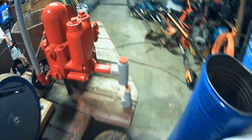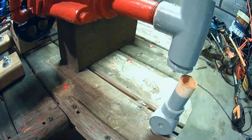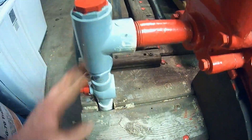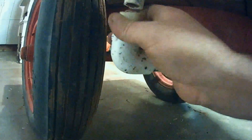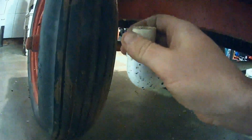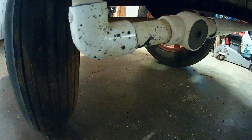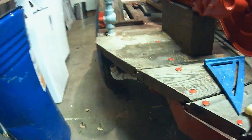So the next thing I need to do is be Mr. Plumber and fix this PVC misalignment. I'm just going to make it a little wider right there, cut the line and pull it back, put a coupler in it. I pulled out the jigsaw and widened out the hole, took off all the plastic parts to get space in there to do it. I just need one coupler — should be enough play to push it in. If not I may have to cut the line and add a second coupler, but I think it's only about a quarter of an inch off. I'm going to go through my supplies and see if I can find a three-quarter inch coupler.